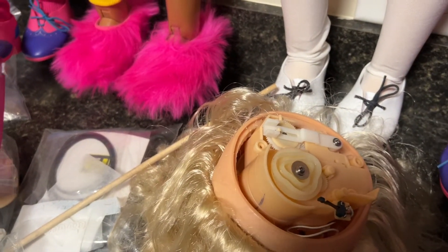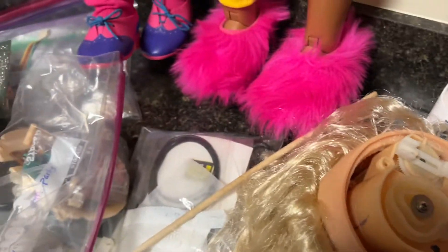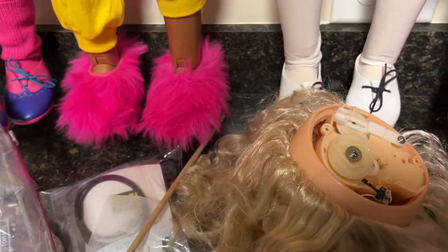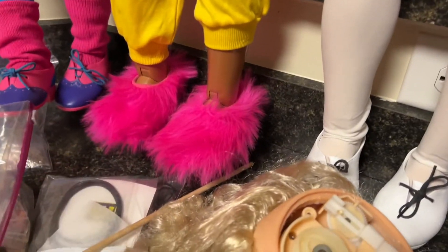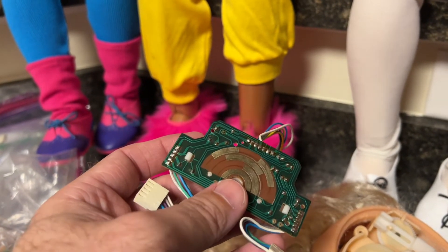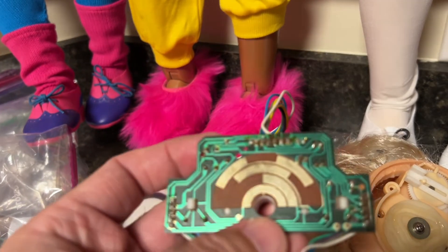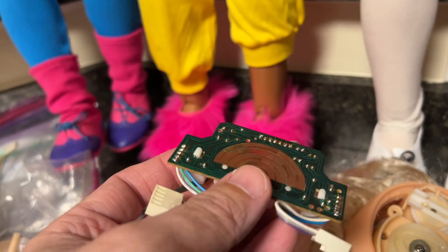That's kind of the inside of what you're looking at. It takes me a couple hours — it's very complicated. These wires are super fragile and very easy to come loose. You also have all of this going on underneath here that goes into the body, and this connects to a microchip reader that makes the head go left and right. When you first open a Jill and look up at her head, there's that metal bar that goes down through here — those wires connect to the arms. Right here is the track, that shiny gold part — it's like a little rake. That little guy rakes across this, and that's what reads to tell the head to go left and right.